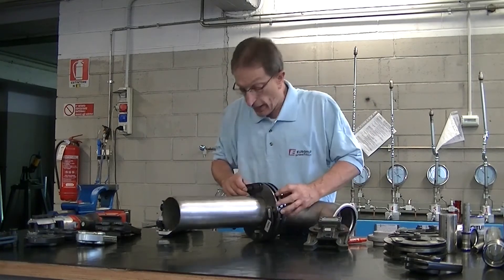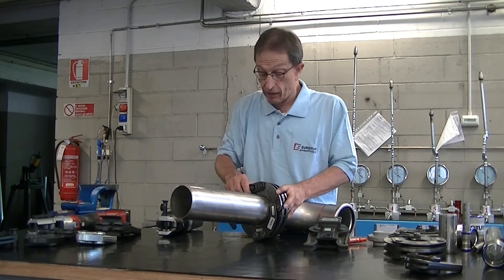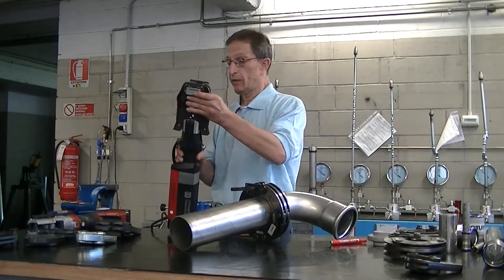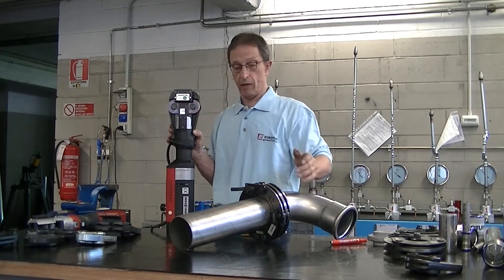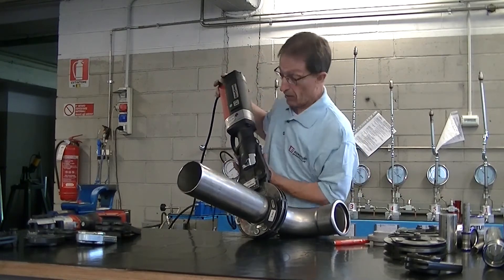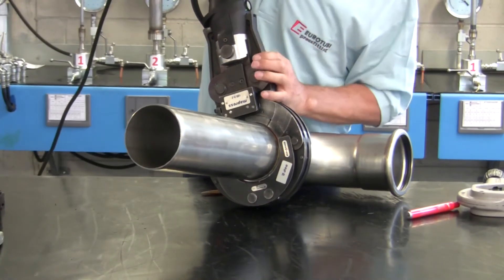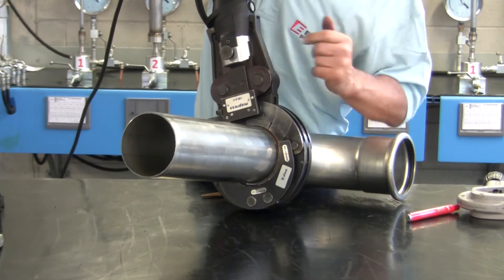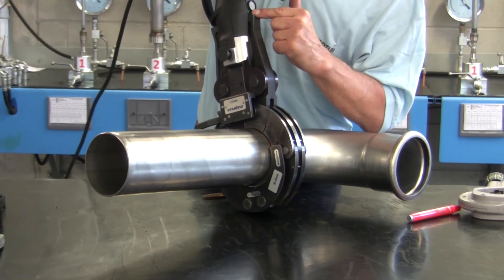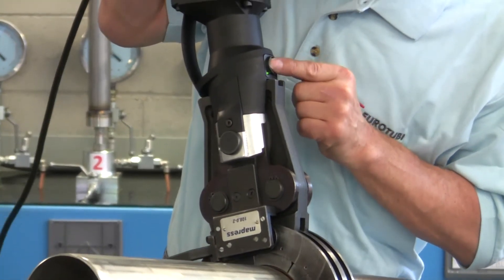The operation takes place in two stages. If I don't perform the second pressing, I can't remove the chain — this reminds me that the pressing isn't finished yet. We insert the second adapter on the pressing equipment and put the adapter on the chain. The check light is flashing because the pin is not completely inserted. If the machine is not ready, the pressing does not start. Once pushed completely in, we make the second pressing.